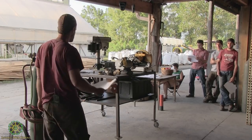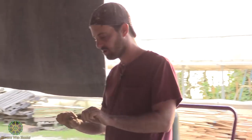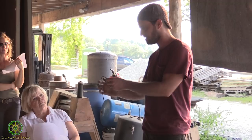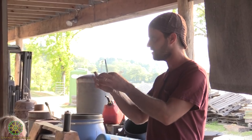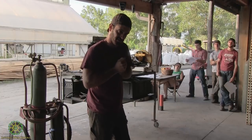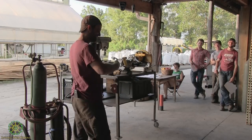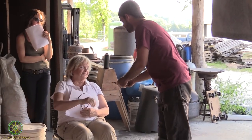Stress hardening is what happens if you overwork a piece of steel. Now you can harden this, like I said, by heating it up and throwing it in a bucket of water. The blacksmith guys do that all the time. Or you can harden it by bending it. I've actually made that quite a bit harder right there than it is down on the tip. And it's going to get increasingly harder to bend that. Then it's going to warm up a little bit and it's going to break if I overdo it. Now I can sit here and do this, or you guys just trust me that it's going to break. You can actually feel a little bit of heat right there at the tip that I just generated.